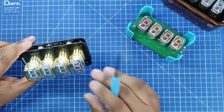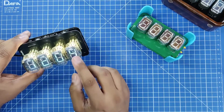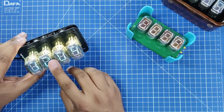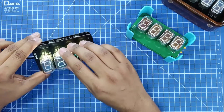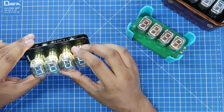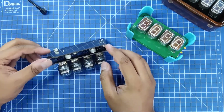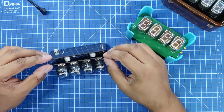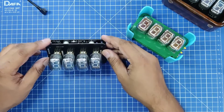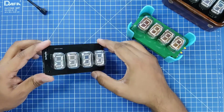The glow is uniform. You can also change the VFD brightness — there are ten levels of brightness. This is the maximum brightness it is set to, and I'm not over-driving the tubes to make them very bright because that would reduce their life. For the design I used two PCBs, with an offset PCB holding all the circuitry. I wanted to keep the front look very clean, so there is no trace on the front PCB.